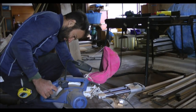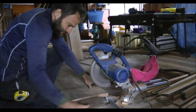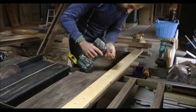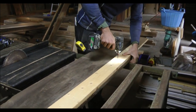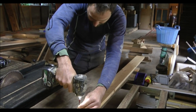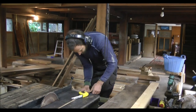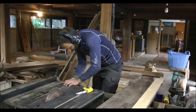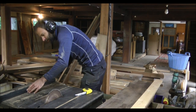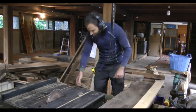It starts with a few cuts to make the boards even and properly fit the frames. There's also a fair amount of damage to the boards that needs to be cut away. Making the edges straight and even is also key — the boards have to fit together snugly in order to protect the rice husk insulation underneath. These boards have rough edges from years of use, and a simple table saw is the perfect tool for the job. With the unique nature and scarcity of these boards, the old adage — measure twice, cut once — is key.